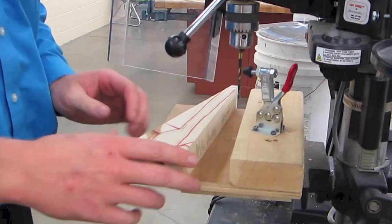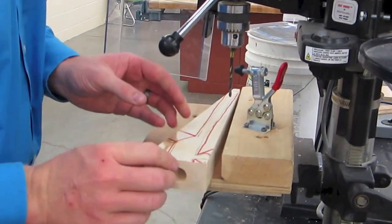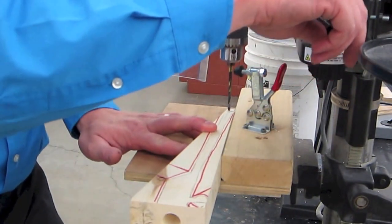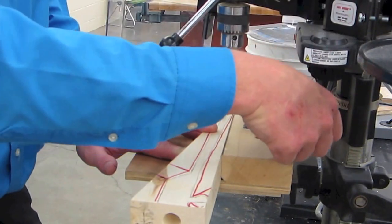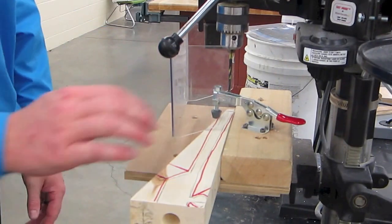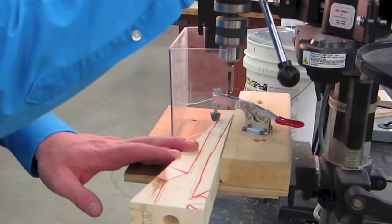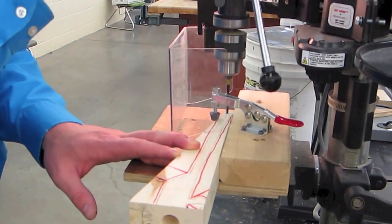First thing I have to do is look at the bottom of my car where my name is. I put that tight against this board here - that sets the drill bit six millimeters from the bottom of my car. I line up with my axle hole that I'm going to drill. Holding it tight, I line it up and clamp it in place. Now this car can't go anywhere. Close the guard, clamp, close the guard, then we turn the drill press on - it's spinning super fast - and here we go, we're going to start our CO2 car!